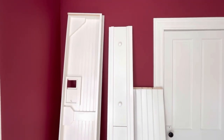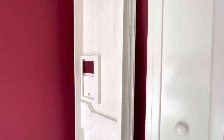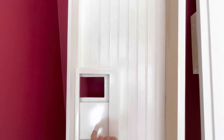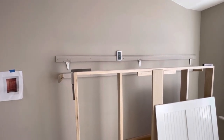The crown was built from poplar boards to create the frame and structure, then capped off with beadboard plywood. It's mounted face down — the smooth side of the plywood is on top, the beadboard is inside — and then there's a bit of crown molding wrapping around it. This little door you see here is to provide access to the thermostat, which is the one thing in the way of this project.